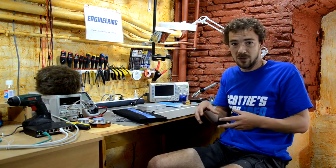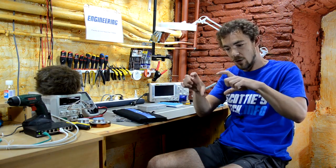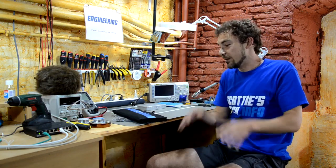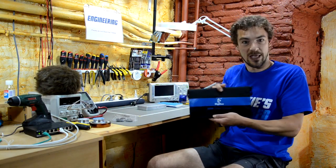If you don't like the big size of this and you want to go with a small one, you can — just be aware that when you have these very small things, even some of the smaller units where it folds open and has multiple panels, they still have relatively small charging currents compared to this thing, because the larger the panels are, the more actual charging current you're going to get. At this point the technology is not really good enough where you should go with a really small one — at least I certainly don't think so. So I recommend the BigBlue 28 watt solar charger, and if you want, get a USB power bank too.